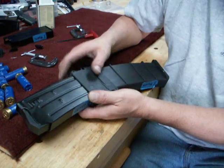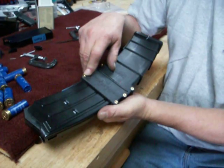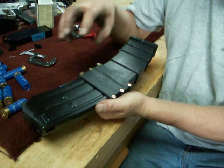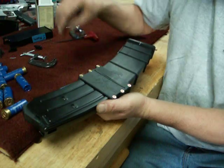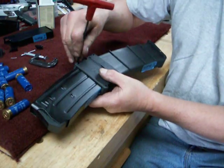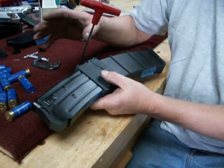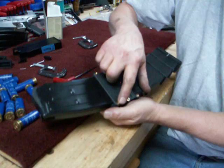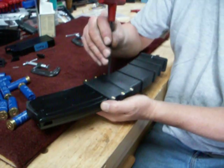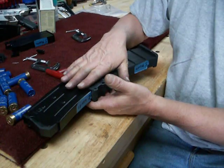There are a couple of things I want to tell you about putting the adapters together. First of all, these are brass inserts that are pressed into the adapter and they crush a little bit when they're pressed in. The first time you put the bolts in from the back side, you're going to be spreading that brass part. It's best to start the screws from the back side the first time and run the screws into all six holes and then take them out. It will make it much easier to put them together from this side.